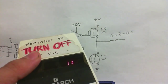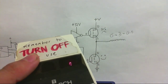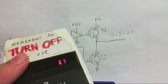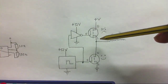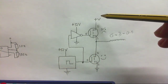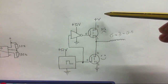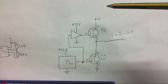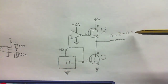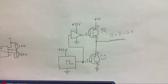So that's 12 minus 3, minus an additional 0.5, and we get only about 8.5 volts. There's quite a substantial drop across the MOSFET, and it doesn't matter what your supply voltage is - this could be 12 volts, 25 volts, 50 volts, or even 200 volts. The voltage you get out is gonna be what I just mentioned. So it's a terrible way to connect up your MOSFETs.